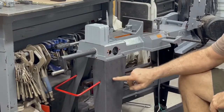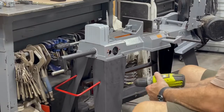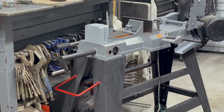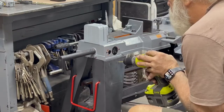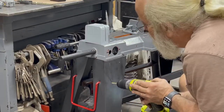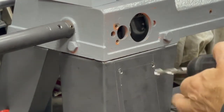The first step to finding this rectangle that you want pretty precise is to drill a hole in each corner, right, and close to the corners you can get, right? See how this goes. So all you really need is two opposite corners for a saber saw to easily cut it out.